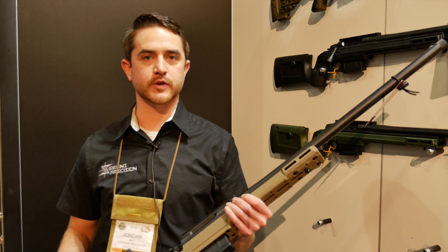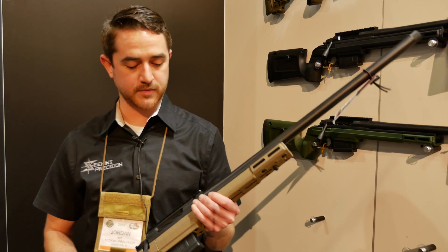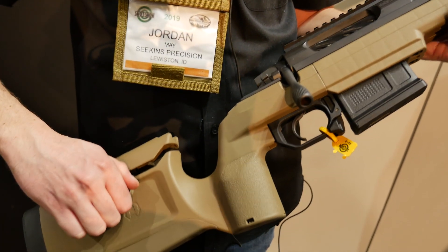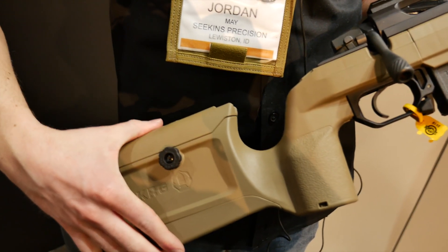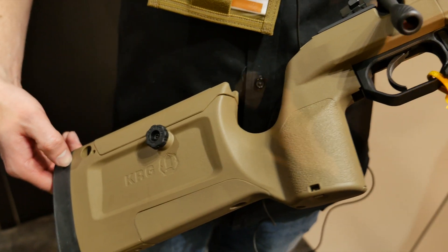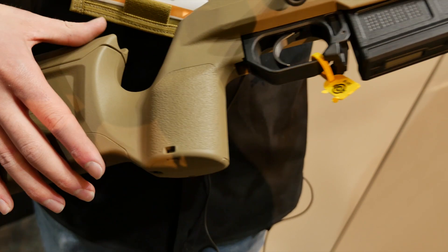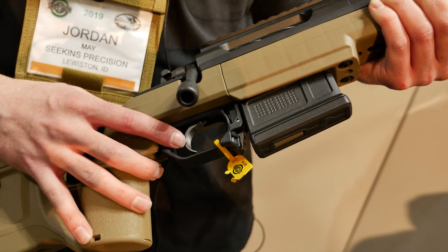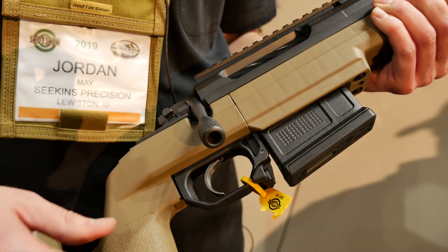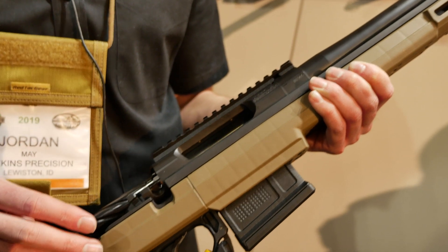We also came out with the Havoc Bravo a little bit before Christmas, just trying to get some extra advertising out there before SHOT Show so people would be ready and know what they're asking questions about. It runs off a KRG Bravo chassis, new that we're using this year. It does come with the adjustable cheek piece, so if you need to adjust the cheek rise for your cheek weld. Also comes with a series of spacers if you need to extend the length of pull — anywhere from 12 and 3/4 inches out to about 14 and 1/4. Vertical palm swell, intended more for PRS-style shooting. Comes with a Timney 510 trigger — single stage, adjustable from one and a half to four pounds. Does have our proprietary Havoc action on there, the same as we had on the PH-1 from last year, still selling this year.